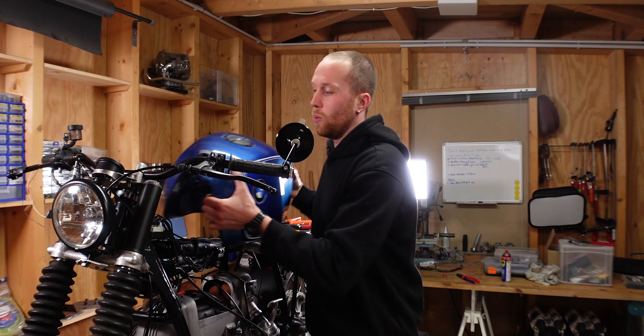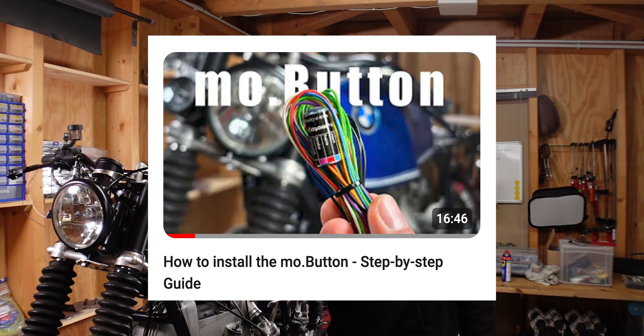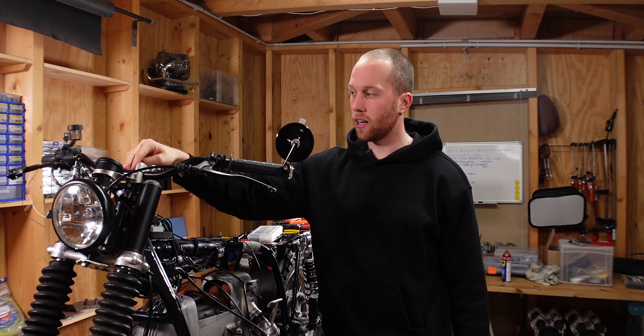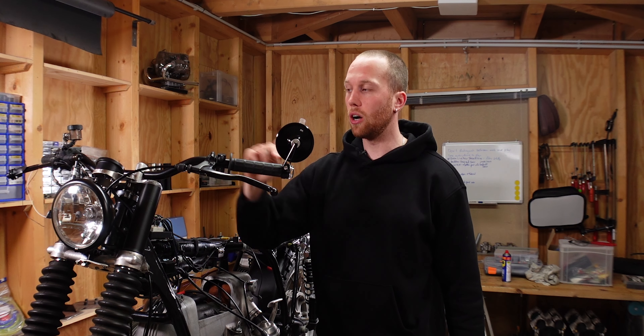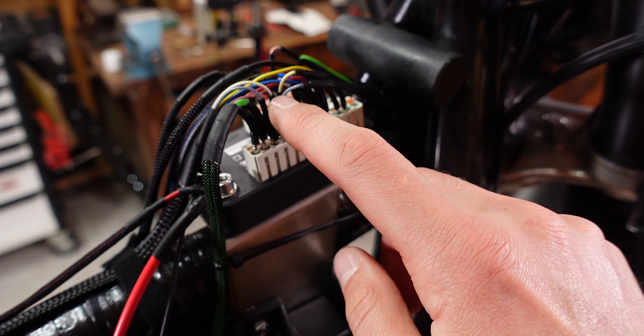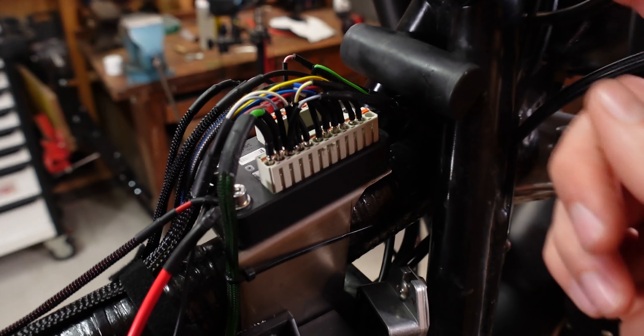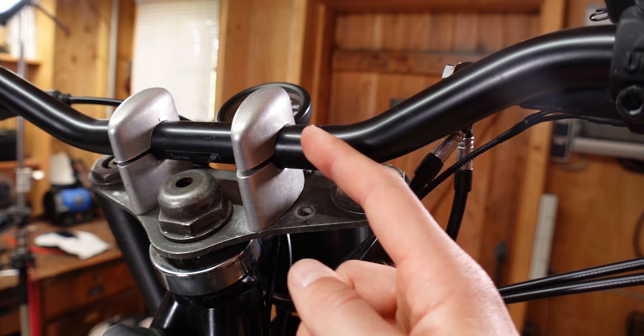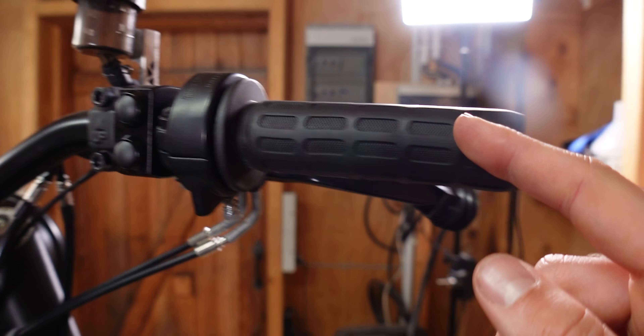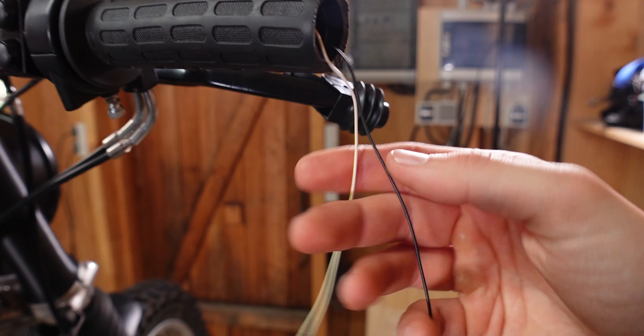The first thing you need to do is the wire routing, and I already did that when installing the MoButton inside the handlebars — I'll leave a link to that video up there or in the description. Basically you need to drill a hole in the bottom of your handlebars where you can run the positive lead for the right and left hand indicators and the two ground wires through, then back to wherever you need to hook them up. We already have the two positive leads coming from the output side of the MUnit, running down through this clamp inside the handlebars, and now we're just going to install the indicator.